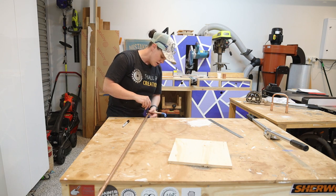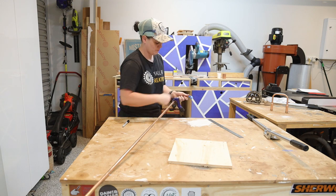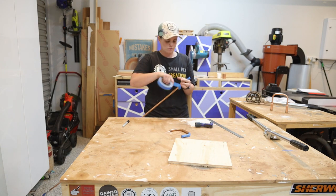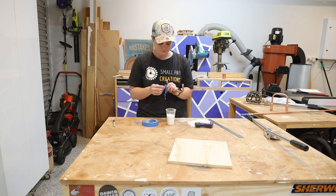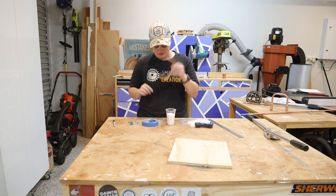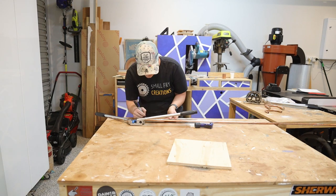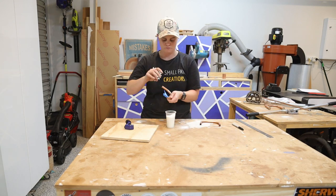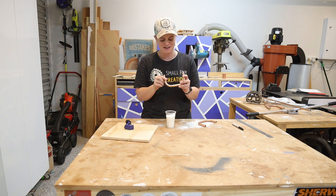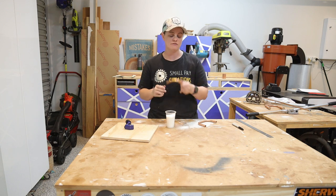Let's get this pipe cut. Keep in mind that sugar is going to go everywhere. You know it is completely clear when you can blow from one end out to the other really clearly. So now we've got that, we need to rinse and repeat and make another one. If you do get sugar stuck inside — because that does happen — get yourself a straw or even a screwdriver, stick it down the pipe and loosen it, and just keep tapping. It will eventually come out.